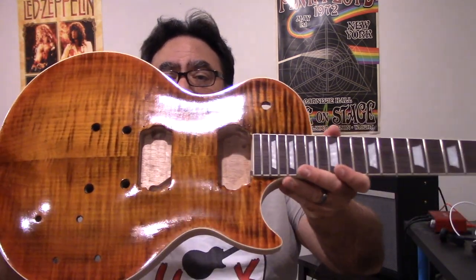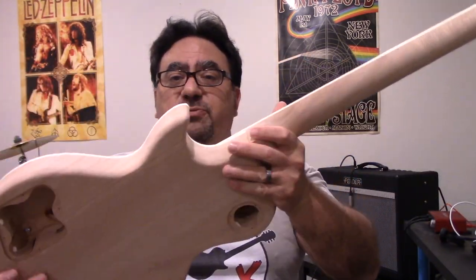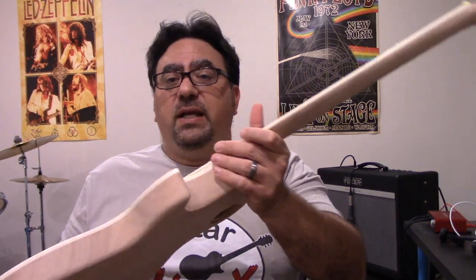The reason I haven't polished it yet is because the next step is to use filler on all the mahogany, then once I sand that all down I'm going to put tung oil finish on that, and then polish the whole thing before putting the hardware on. In any case, I hope you enjoyed this tutorial on how to use True Oil to finish the top of a guitar on flame maple veneer. If you did, please give me a thumbs up — I'd really appreciate it. If you like what the channel has to offer, it'd be awesome if you could subscribe, and I'll see you again soon.